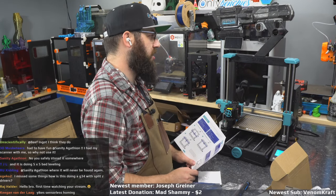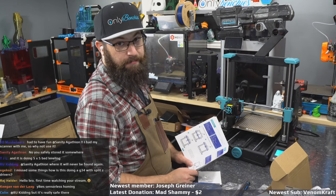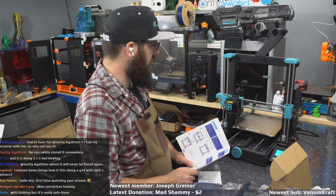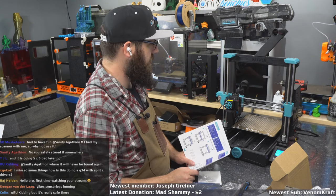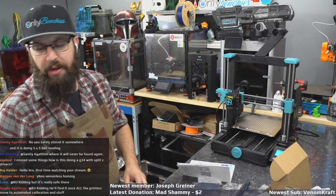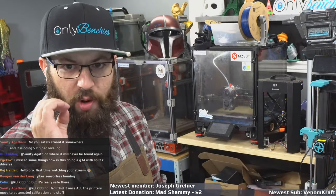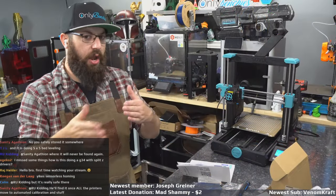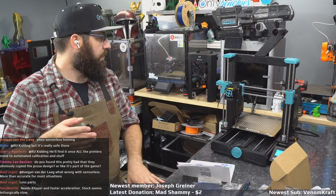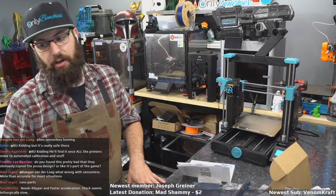So now we've got to go all the way to the top, and we could do the Prusa way. But also this has end stops. Sensorless, so maybe it's doing the sensorless for the Z. We'll see. I want to see how it does this. Sensorless homing is fine for all axes except for Z, because your XY home, sensorless is only good within a full step. So you're fine sensorless homing on your XY. On your Z, you don't get enough accuracy to be worth it.